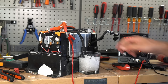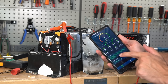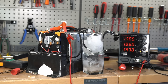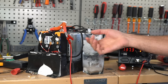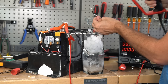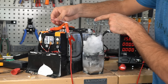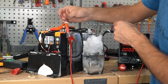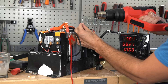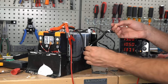Now we're charging and here's some ice — let's see if it works. The app shows only one sensor reading two degrees Fahrenheit less than the others, which is not the case in reality. Testing with high temperature on the terminal sensor confirms those sensors are high-temperature only. Then we dip the cell temperature sensor in cold water — it disconnects charging immediately. The cell sensors do work for low-temperature charging protection. The fourth sensor is not working for low temp, so there's only one temperature sensor that does low-temp charging protection — but it still works.